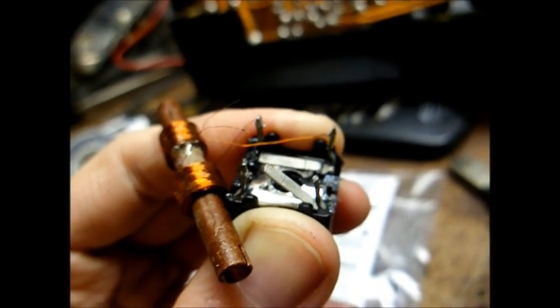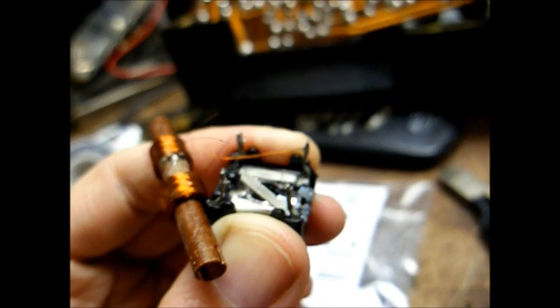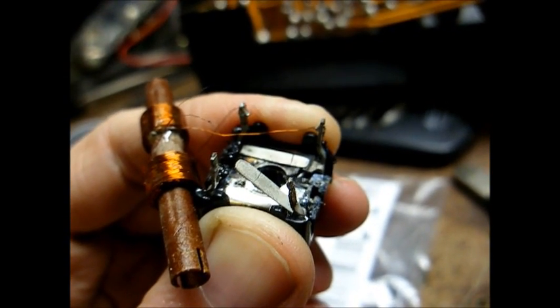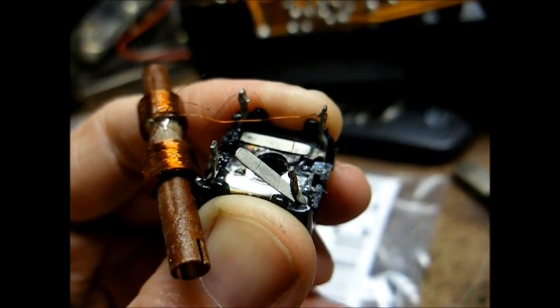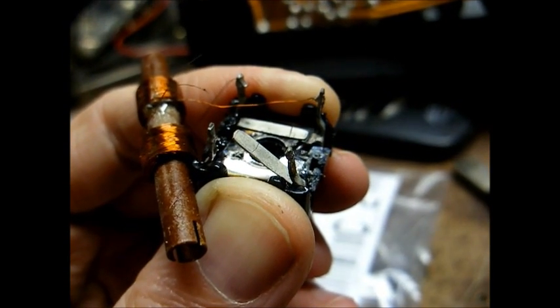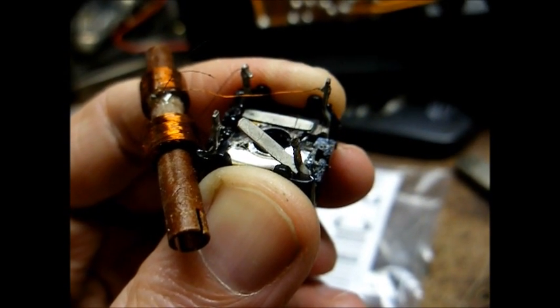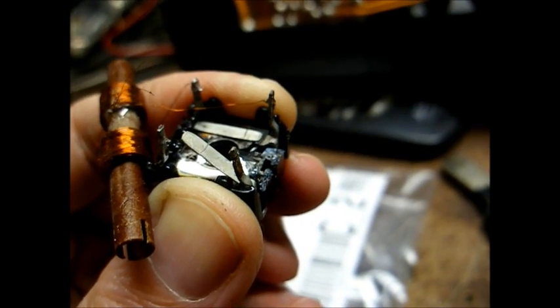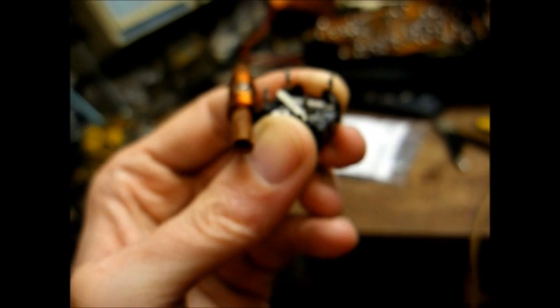Okay, I've got the wafer removed, and if this IF transformer ever works again, it'll be a miracle, but we're going to try. Now that we have the wafer removed, we need to bend up the little contacts that help make up the internal capacitor, and then cut off at least one of those contacts per winding for the primary and the secondary, so they won't short once we remove the mica insulator. And then we'll put it all back together and install our new mica capacitors.